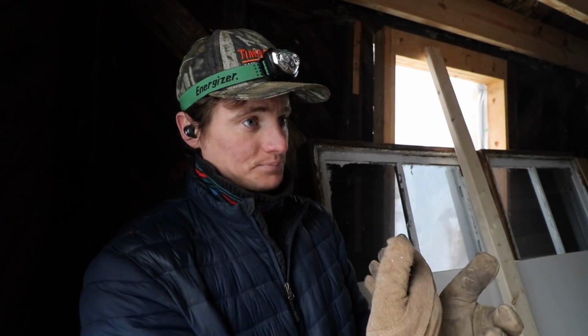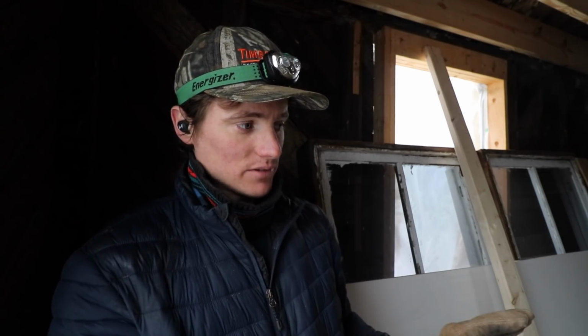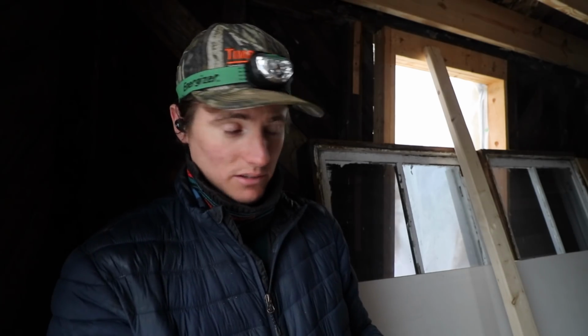So I did a lot of that stuff just based on reading on how to do it and seeing it. Because when you gut a house out to renovate it, a lot of times you are repairing or replacing something. It's not going to be really done all that much differently. It's just going to be updated. So a lot of times you just like, okay, I like where all the receptacles are. So you just pull the old boxes out of the wall, put the new ones up. You might adjust a little bit, run wires between them, and then that's taken care of. But the hooking into the electrical panel and different code related stuff is a little bit trickier, so he was doing that stuff, and I'm just staring over his shoulder asking him what he's doing the whole time.